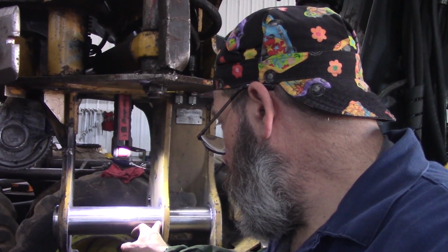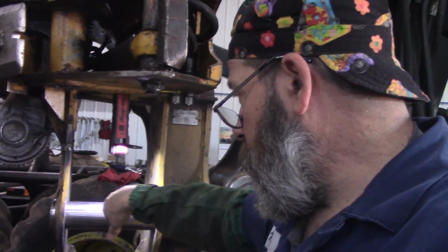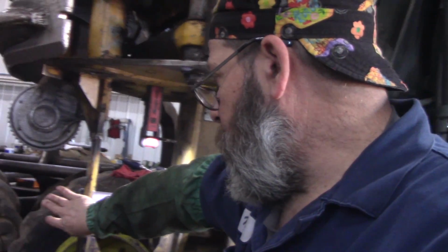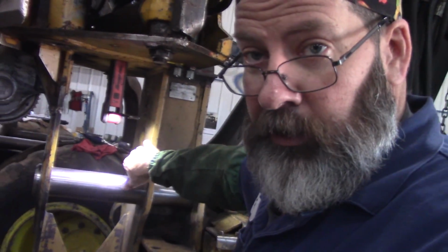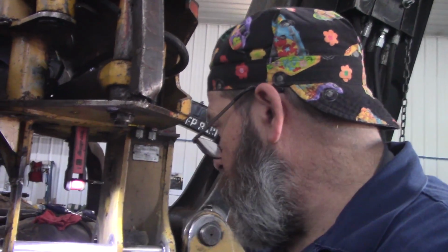And like I said, I had my machinist buddy make me 6 different bushings for the 6 thicknesses. I put the pin in, pushed it up tight, slid the bushings over, and all I did was scribe a line around it and grind to the line. It's like connecting dots, dot to dot in the coloring book. Grind to the line and just keep polishing till you get it right there.